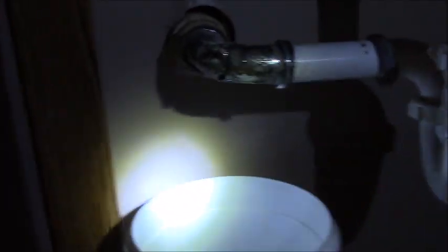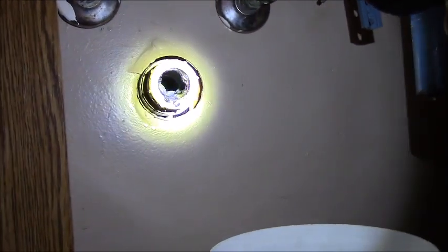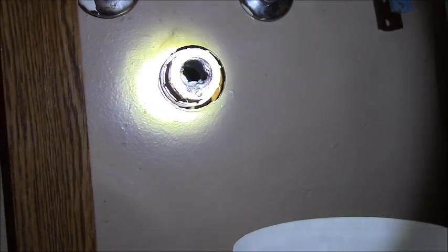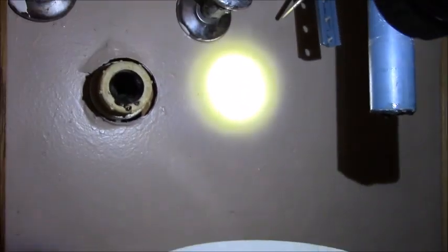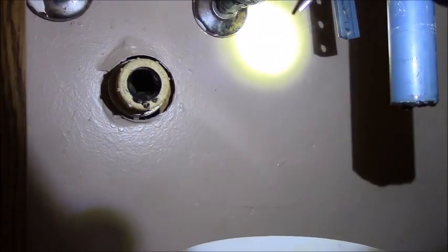I can't really keep you in here to see what I'm doing watching me take it apart. Those are just compression fittings. I got to drop this tail piece off, drop this off. Well, I think I managed to snap the pipe off inside the plastic fitting here. And oh, look at the way that sludge is built up. Alright. But it looks like the pipe comes from this direction. So that's maybe a good thing, because we'll just have to poke a hole through and bring it out over here. The water pipes, I guess I can just put 90s on them and bring them over.